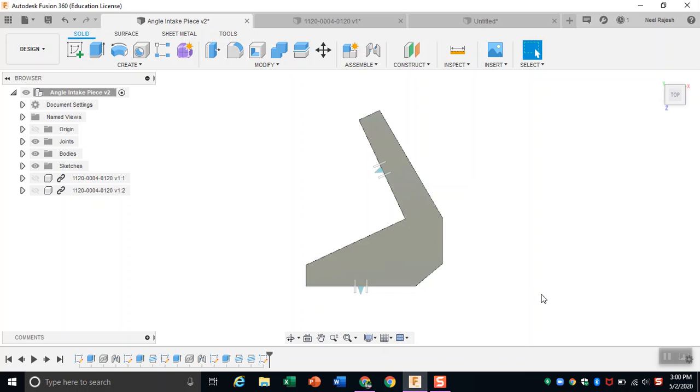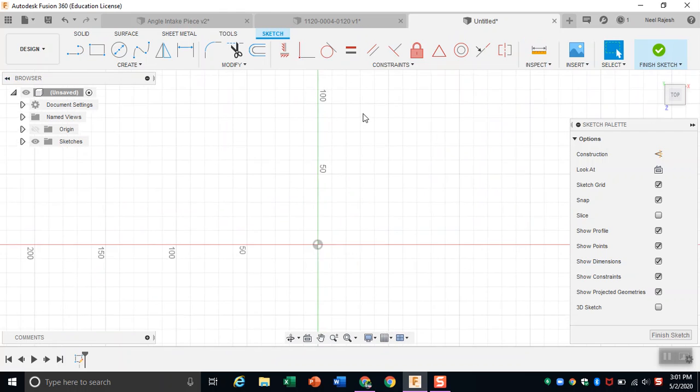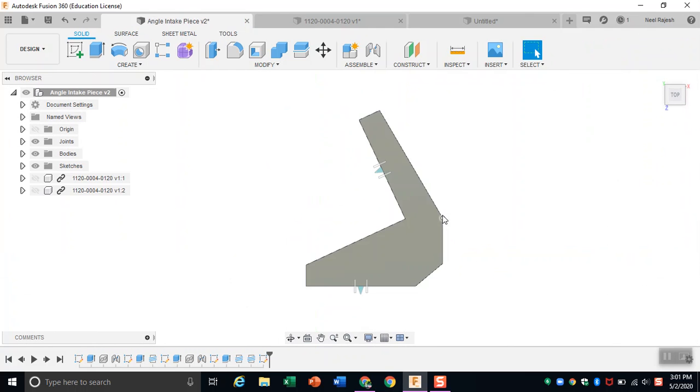You can see that this is angled while this is the place that holds the channel. So we're going to create the angle first, and then we're going to create the place for the channel to sit. Right now we have a 120 degree angle. First, make a base. You can always make the base big, and you can always chop off small pieces later, like we did here, because these pieces were cut off from our previous base.